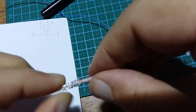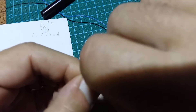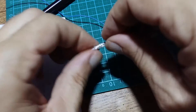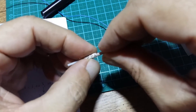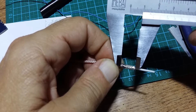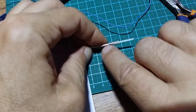Pay attention that it stays as close as possible to 3 millimeters, 3.5 maximum. If it is 4 millimeters then it should be shorter. Now the soldering iron is on the opposite side of my room - I will briefly solder this end. 11.3, 11.4 - okay, that's it. Now do not cut yet this part because we need to make the opposite side.